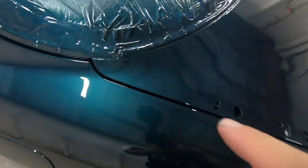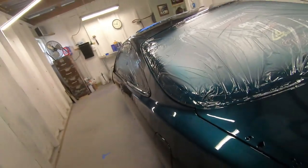The game plan now is I'm going to wait a couple more hours and then pull off some of this tape. Anything on a hard edge — like right there, for example, where the paint goes right up to the tape — I want to break that before the paint dries, because there's a chance of the paint actually coming up if you wait too long. So I'm going to wait a couple more hours and then we'll get right into that.